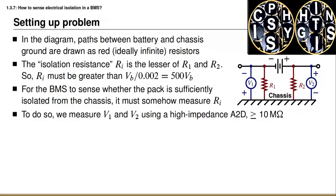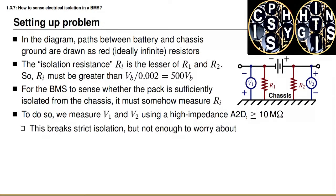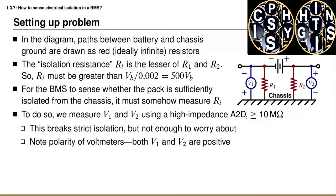To measure the two voltages shown in the diagram, we use a high-impedance analog-to-digital converter with an internal resistance specified to be greater than 10 megaohms. When placing these voltmeters in the circuit, we are technically breaking the isolation we are looking for by making a pathway between one terminal and the chassis. However, because the voltmeter resistance is greater than 10 megaohms, we ensure that less than 2 milliamps of current will flow for most batteries, so this is not breaking isolation according to our specification.